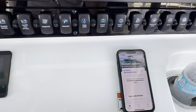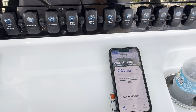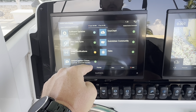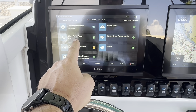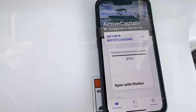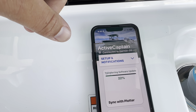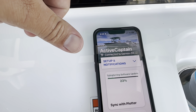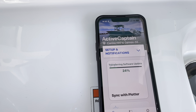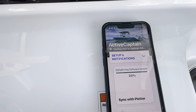One of the most confusing parts is when you get into the Active Captain app to get started, it's going to want to do all this stuff using your home WiFi or whatever WiFi network is closest to you. I find the easiest and simplest way is: don't connect your phone to the marina or home WiFi - connect your WiFi to the Garmin unit and have those two connected. Then do all your data transfer, mapping, and everything through Active Captain using the cellular 5G on your phone. That way it keeps things separated, because you can't be hooked up to two different WiFi networks at the same time. We're connected to the Garmin's WiFi right now, and I'm doing all the setup through Active Captain via cellular 5G. You saw me switch the settings over to WiFi or cellular earlier in the video.